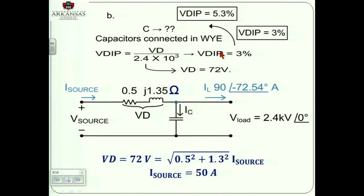Because we want 3%, we can increase it, we got a bigger one. If you have a smaller one, you wouldn't get 3%, right? You would get a voltage drop which is higher than 3%. So you go for the nearest, largest, because you want to guarantee that you are going to get less than 3% because you want to solve a lamp flicker problem. Why were we choosing the smallest capacitor bank before? When we were taking into account what? Overvoltage, overcompensation, right? So the criteria change.